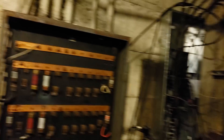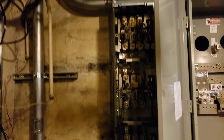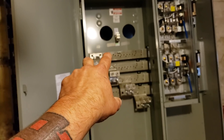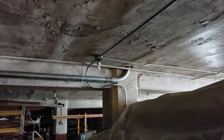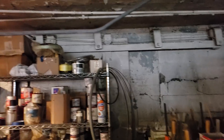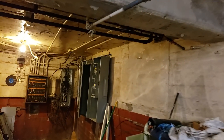There's an elevator feed for this elevator over here, so that's all just temped in. I can do all my work, pipe everything in, put in my new panels, and keep them going until I put these risers in and do my cutover. There's a panel on the first floor — it's cored out, goes straight up. We stopped right there because we have to move all this stuff, and then it'll come over and I'll offset it to that wall and tap into the side of this meter bank.